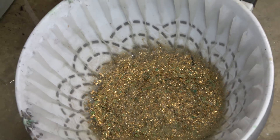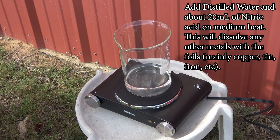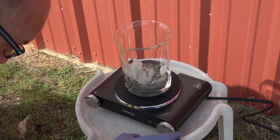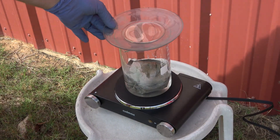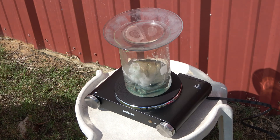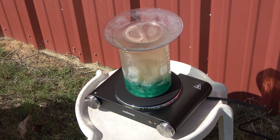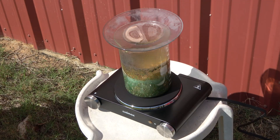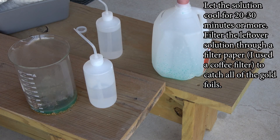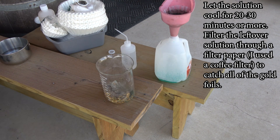Now we're going to use some distilled water and a little bit of nitric acid to dissolve any remaining metals — mainly copper and a little bit of iron that was in those cards — just to make the end process a little bit nicer. You can skip this step if you're dealing with pretty clean cards. You can see the solution turning blue or green, which indicates the presence of copper, so we were doing the right thing boiling this off. Now we're going to let the solution cool and filter it one more time using double coffee filters, catch all the gold foils, and discard the solution properly.